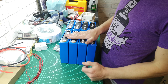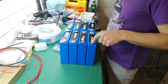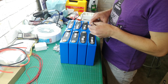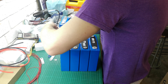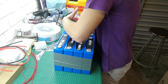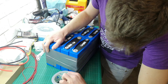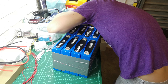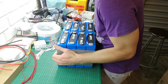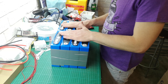You want to alternate your poles because we're connecting in series. Here's the negative, positive - and we want a negative here, positive, and connect all the way down. At one end we'll bridge across, and then we'll have two terminals at the end where we connect our battery management system and outgoing cables. That is basically all the cells nicely stuck together - it's pretty sturdy. In total it weighs about 22 kilos, which is not too bad when you compare it to a lead-acid battery, which would probably weigh about the same for a 100 amp hour battery.